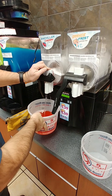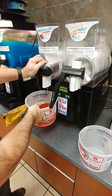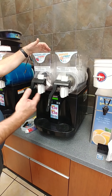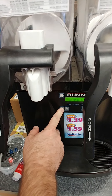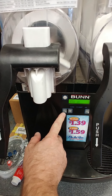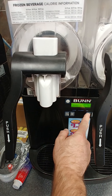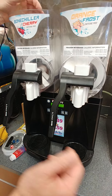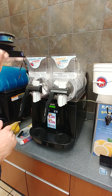We'll finish draining the hoppers and then start disassembling the unit. Now since the hoppers are empty, we need to turn off the hopper drive motors — just press the button repeatedly until it says auger off, and then the augers will stop. The next step is to unplug the unit for safety reasons.